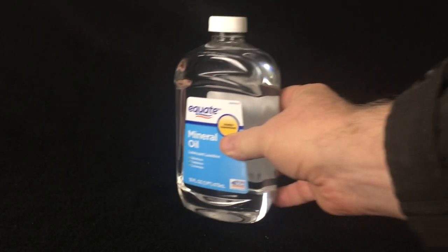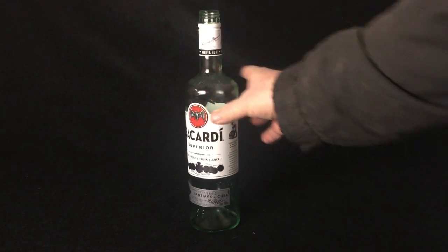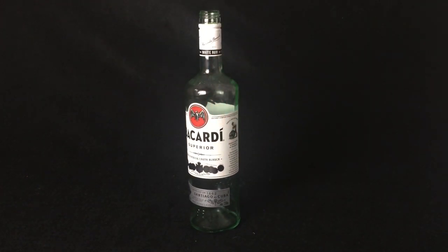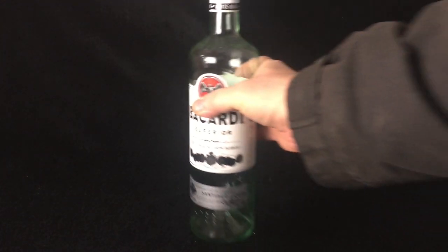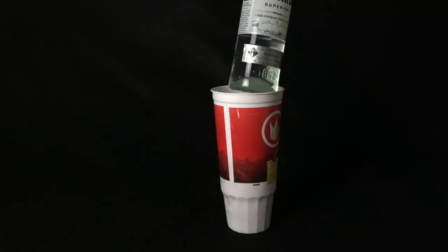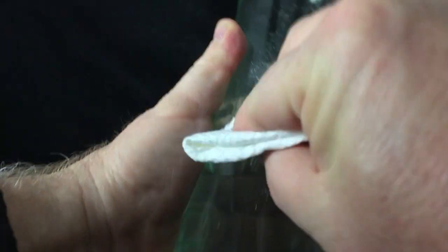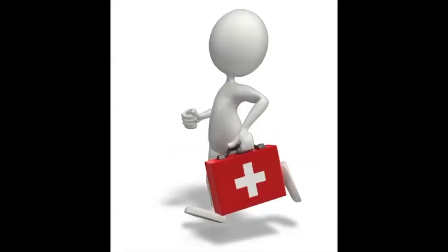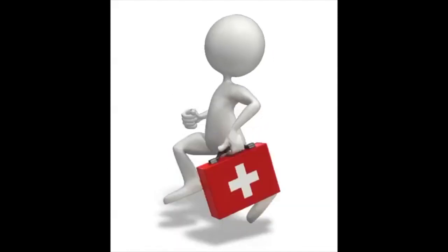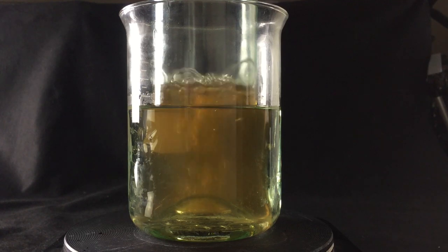And the secret to doing that is mineral oil. Here's what you do. First, select the glass bottle that you intend to repurpose as labware. I'll be building a homemade still in the next video, and I'm going to need a long neck to connect to my condenser, so I'm going to use this bottle. Remove the labels by soaking the bottle in water, scraping off the paper, and then removing any remaining glue with a little alcohol. Now, if you don't want to get hurt while you're doing this, you're going to want to drop in a few boiling chips to make sure that the liquid will boil smoothly.